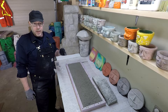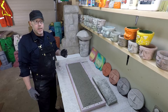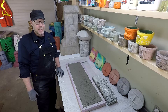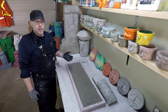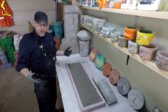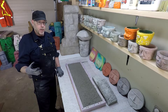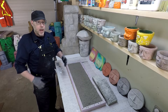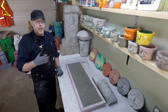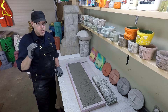The next part of preparing concrete for a patch is acid washing. Acid washing is the standard protocol for cleaning concrete and getting it ready for a patch — except when there's oil involved. Acid washing is actually counterproductive when there's oil because it will bake the oil into the concrete and you can't get rid of it anymore. So first you degrease it, then you acid wash it, then you neutralize it with baking soda or a TSP scrub and rinse. That's how you properly prepare a concrete surface to apply a patch that's not going to fail.